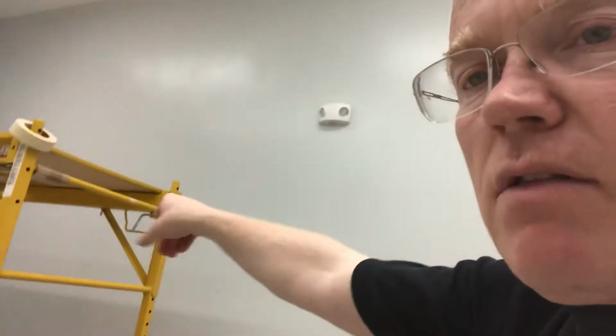But like I was saying, we're going to start in the middle because you don't want to start all the way on the left, and then at the very end you come up with a sheet that's like 4 inches. That's extremely unprofessional. But if I were doing the entire room, I would go around with my paper, marking the paper on the edges, and just seeing where my seams would lay out. And then you just kind of say, no, I don't want a seam over here. This doesn't work out. But in this case, it's all walls, and we're not doing the entire room.